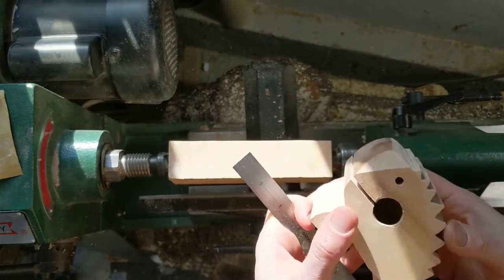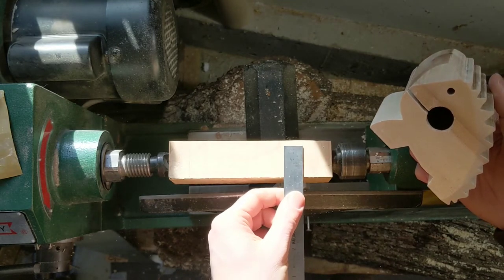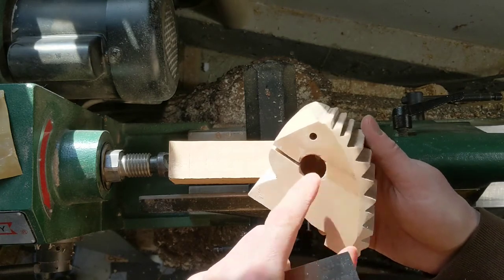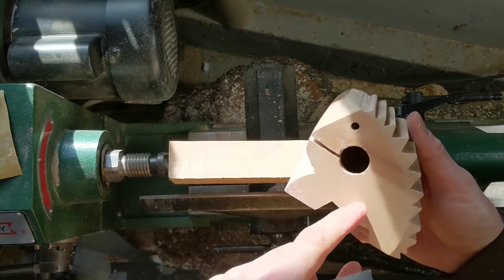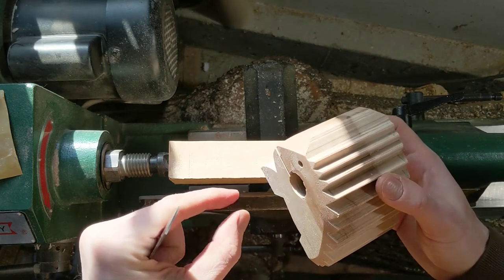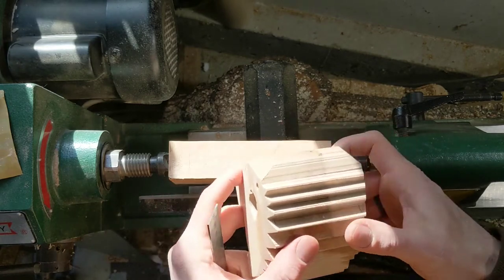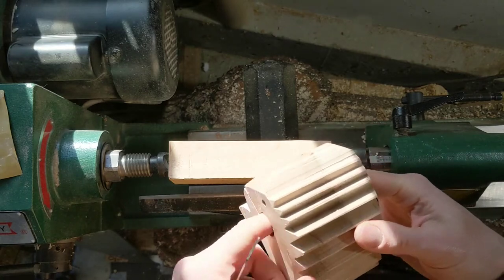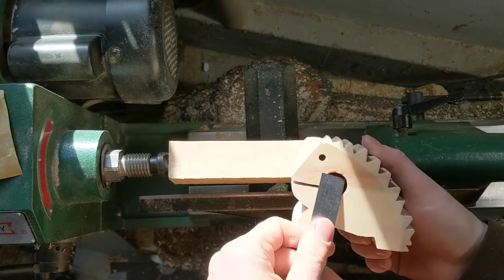And a couple of considerations for that. The first thing is you want, diameter-wise, at least I want part of it to be bigger than the hole here, but most of it to be smaller than the hole so that it can actually rest in the rasp when I'm not using it. It'll actually kind of stick through, but then there'll be an enlarged part on one side that'll be the part you use to strike the rasp or whatever to run up its back. But the handle part, the smaller part, will be small enough to fit through the hole in his mouth so that it can rest in there and then kind of wedge in there because it'll slowly get a little bit bigger. So that means that you have to have something that's bigger diameter than that hole.